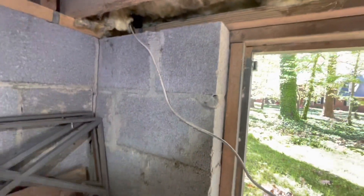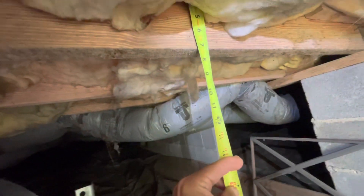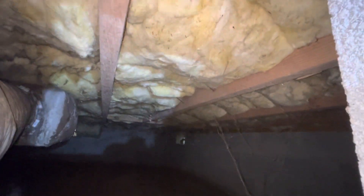Just inside the crawlspace door, it does not feel wet to me. The ground is dry — powder dry — that's great, so far so good. I noticed there is some discoloration on the joist at this section of the house. The joists are two-by-eight and the spacing is 12 inches on center. Picking into the front section, the spacing is different — the front is two-by-eight joists with 16-inch centers. There is a solid masonry center beam.